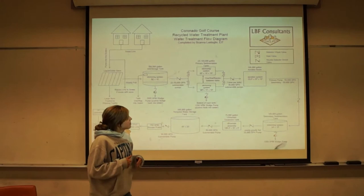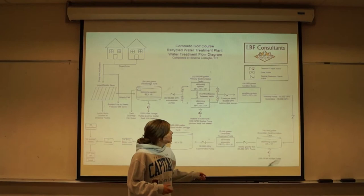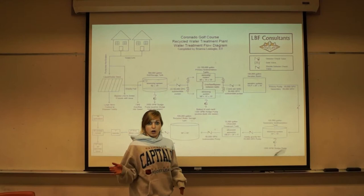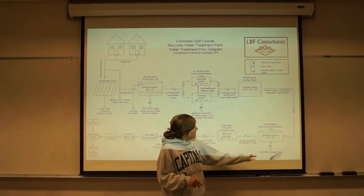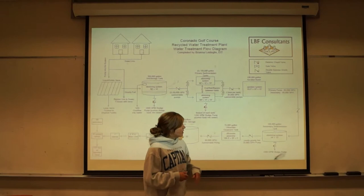From there, we get pumped into our aeration system. Our aeration system has a dissolved oxygen meter which is attached to a variable frequency drive which tells our system how much to aerate the water. From there, it goes into our secondary sedimentation tank — another stage of sedimentation. It's a very large circular clarifier with one rake arm that goes around the top to skim off all the lighter particles, the oils and the fats. There's a sludge pump at the bottom for anything heavy that might settle out, which at this stage we would not expect too many heavy particles as they would have already settled in primary sedimentation.